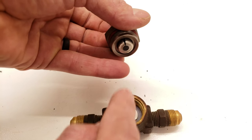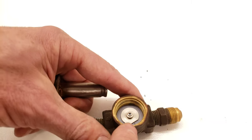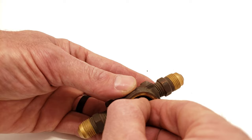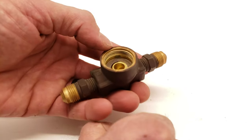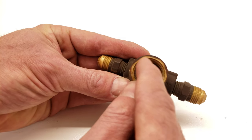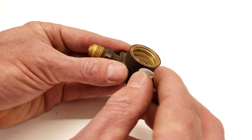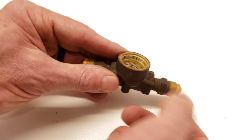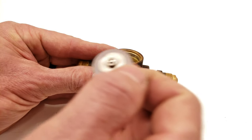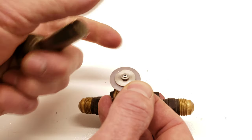You can also see that little rubber piece right here is going to be pushing right in the middle. You'll also notice that there's a slit in the iron core all the way up, and also a hole right here — that's so the refrigerant can actually get up above this assembly as well. This is your disc, and it just rests on that little ridge right down there. The refrigerant travels up and then down through that hole. That little screen is to protect from any debris so that the disc can seat properly. The refrigerant pressure will be pushing this up when the electromagnetic coil has power, and when there is no power, the weight of the iron core and the spring hold the disc down.